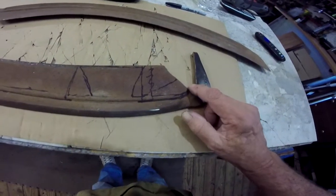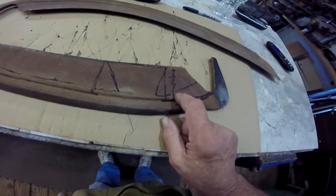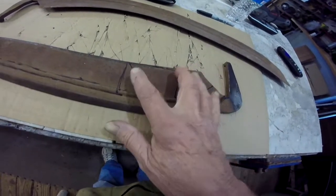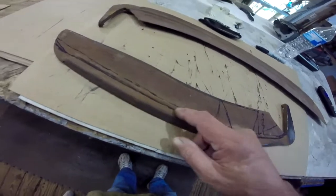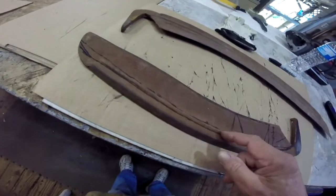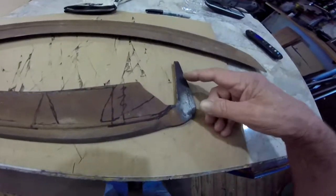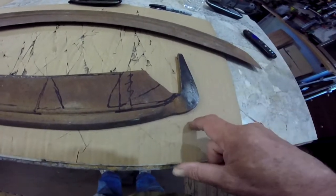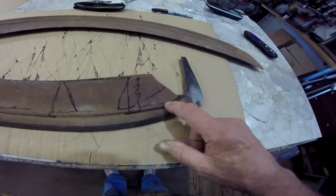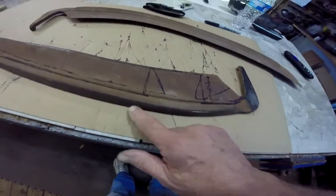What I'm going to do is remove some of the steel with my grinder, with the cutting wheel. This will be the blade section in here and I'm cutting it big until I get it to where I know it's going to work. And this will be the shaft, and the handle end will curve over this way. But this hook right here has to go the opposite way. I'm going to do this today because I think I'm almost sure this is all one piece.